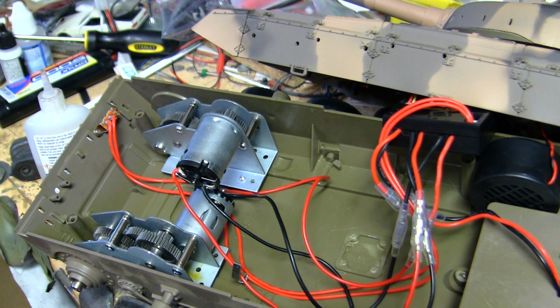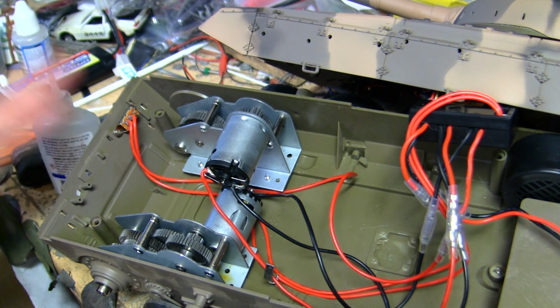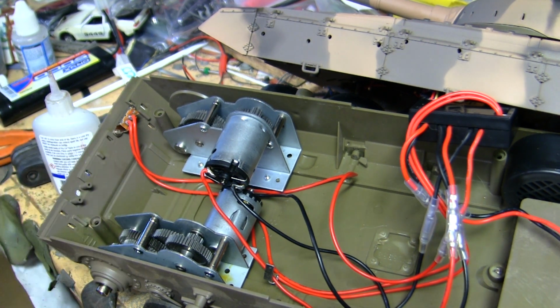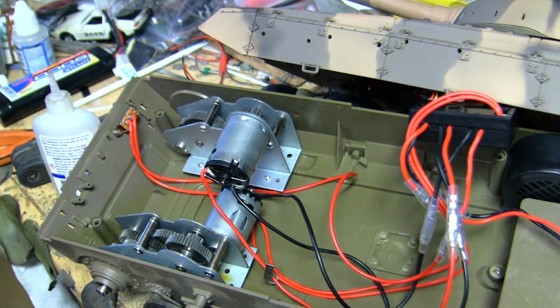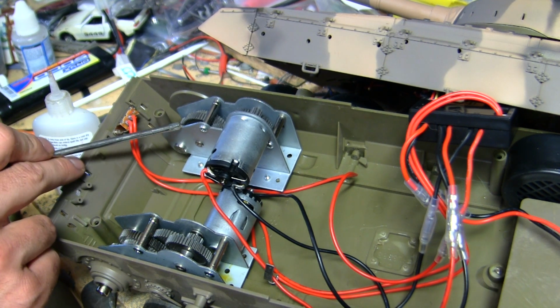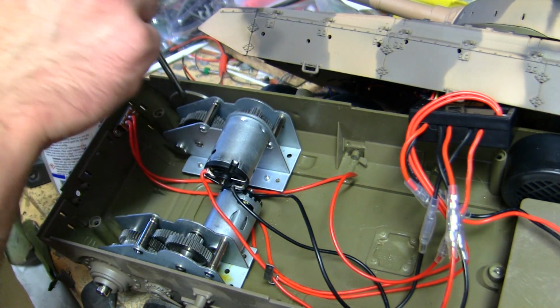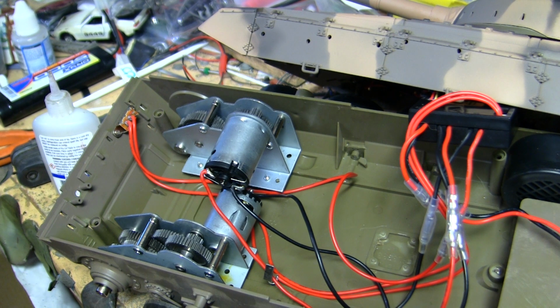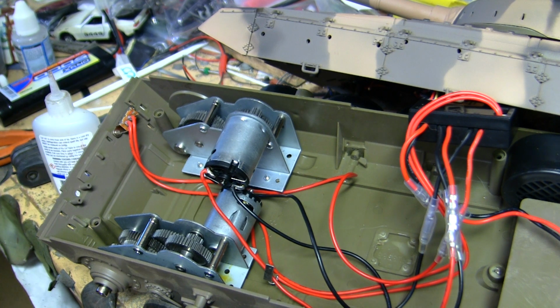So from here, I'm going to go ahead and grab my fasteners and start with the remounting process. I also want to mention that if you have a magnetic screwdriver, this is something that could potentially be a double-edged sword. Yeah, it's really handy in keeping the fastener in place, and it helps you align it with the mounting. However, with the sidewall of the gearbox being steel and with the gears being steel, the gearbox is going to want to suck the screwdriver into it in one shape or another. This is also going to be true with dealing with the magnetic field from the motor. So as you can see, this one's already trying to stick to it. And when you're trying to mount the fasteners on, you are going to have a little bit of resistance to fight from the electric motor.